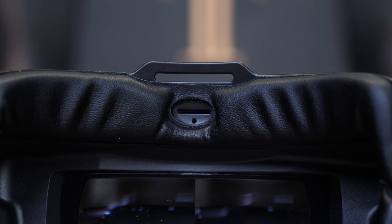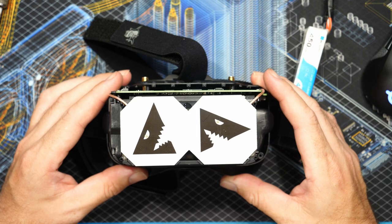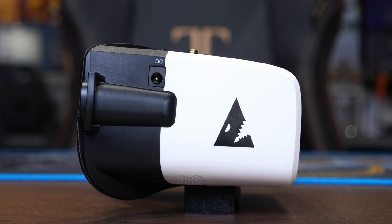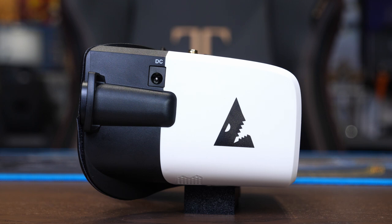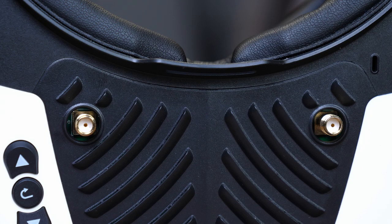It's worth mentioning that this is an HD DVR on these goggles — not the same kind of DVR you may have had on other Fatshark goggles in the past. On the front you'll find a large flat area where the two built-in right-hand circular polarised patch antennas are located inside. On the left is a firmware update port for updating your VTX, and on the right is a DC input jack. These goggles can be powered from 2S to 4S or up to 16 volts max. On top you'll find three control buttons and two additional SMA ports, supporting up to four antennas in total.